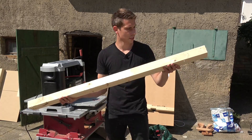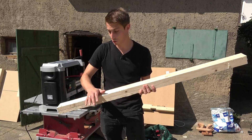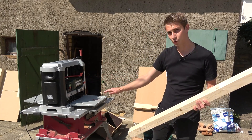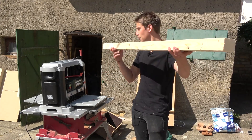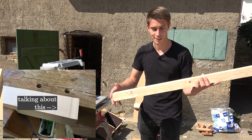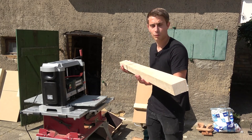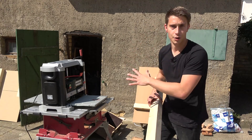I'm honestly surprised about the results. I have a very nice flat surface right now — it feels pretty good, no sanding needed. And even though I'm not parallel to the crown and there's a slight deep line going downwards, the result is pretty damn good. Also the planer didn't cut into the workpiece — no hobelschlag as it's called in German. I'm going to plane the other side now with a slightly deeper cut. This is spruce wood, which is very soft, so we'll try it on harder wood in a second.